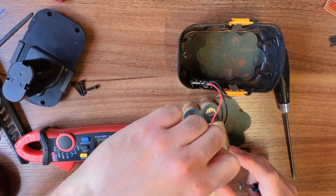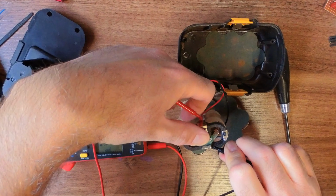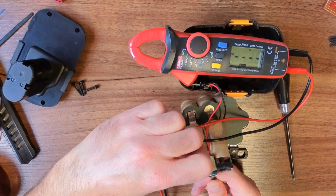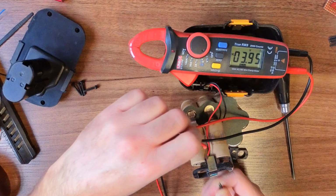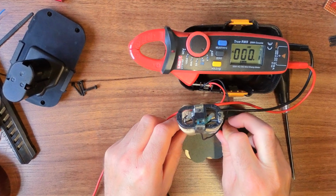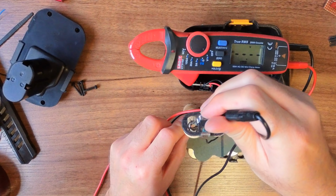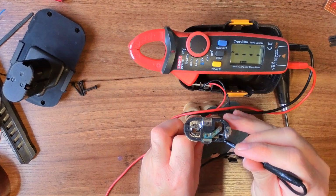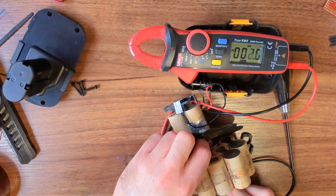So that looked like that was a genuine 4 point something volts per cell, whatever it was. Have a look there. Don't know if you can see that or not. I'll put it there. Four volts and dropping. Oh no, it's just bad contacts. So, are these cells truly dead, and dropping them has just happened to force them dead? I don't know much about the chemistry of shocking NiCads. 1.1 volt per cell there. What's this one? 1.2. So they look okay, I'm assuming 1.2 should be the normal voltage of these cells.